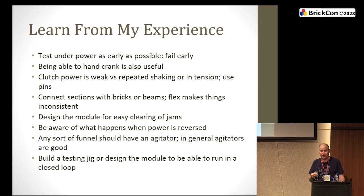When you're learning, these are things I've learned about decreasing my cycle time. Put a motor on it as soon as you can — you've got this mechanism sort of working, put the motor on. Turning it by hand is very easy to cheat yourself, because you can push harder to make it work, or consciously change the rate. Even just your hand doesn't move as fast as a motor. Things that work perfectly well at one RPM might not work at 200 RPM. Get your motor and mechanism set up — even before it's ready to move balls, see that your chain, belts, and gears are all working together.